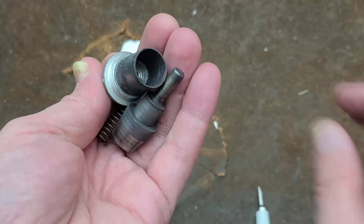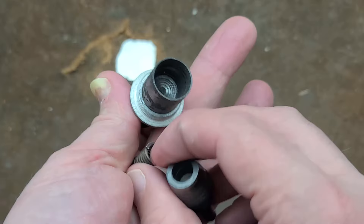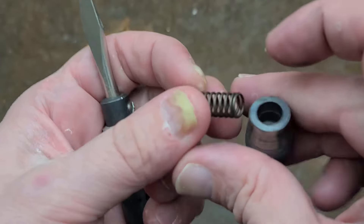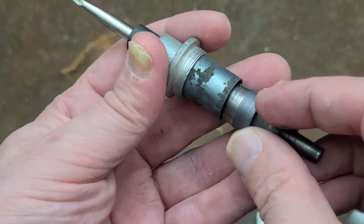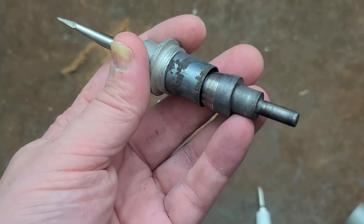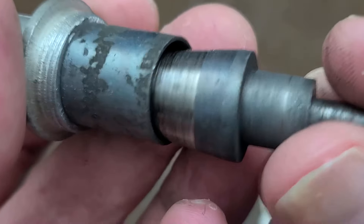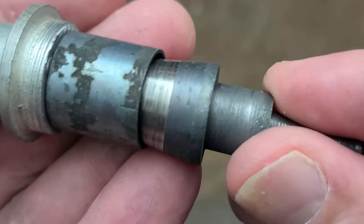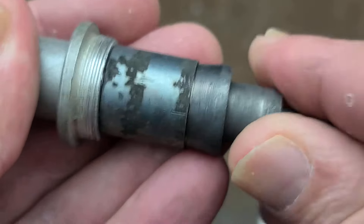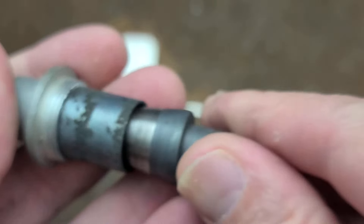We can see exactly how simple this thing is. You do not oil these — and another tip: you don't oil cordless nail guns either. Air nail guns, yes, but cordless ones, no, because they also have a friction drive system and the oil ruins them. All this is is a spring to keep two cones separated, and when you start putting pressure on them, they begin biting in and transferring force, just like a clutch.